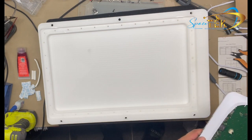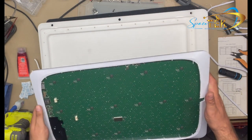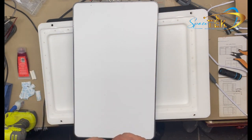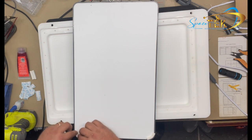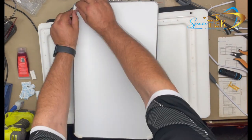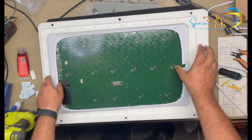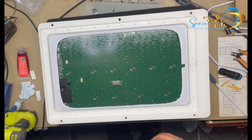First of all, we're going to prepare the flat dish to go inside. We have this adhesive rubber, and we've just put a piece of this on each corner. What this does is give it some grip so it doesn't just flop around inside the casing — it actually sandwiches with the backing plate, which you'll see later. It also puts a small air gap between the two surfaces, just helping with cooling properties and radiant heat from the sun. Once that's all done, we just drop that in and add some more rubber in the other four corners.